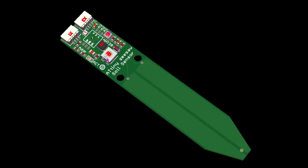Okay, first up, Carter and I are working on Bit Soil Sensor V2 or V3, I guess. We want to do a better soil sensor that is I squared C using seesaw. We did one with the ATSAMD10, but it used the built-in capacitive sensing of the SAMD10 chip. But we wanted to update it, so we did a revision that used an RC timing, so like a low cost soil sensor. That worked okay, but it had a couple of weird effects, and so we decided to take another look. And this one is a square wave filter instead.